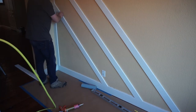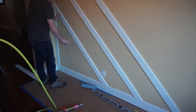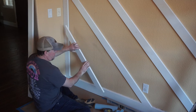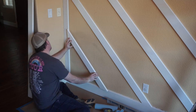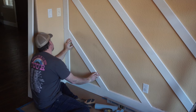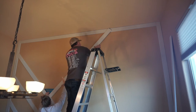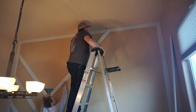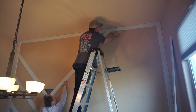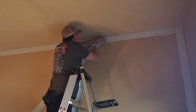Make sure that you wipe up any of the glue squeeze-out on the edges of the trim boards, otherwise you will see that through the paint. A carpenter's square comes in real handy for establishing these first angles, and then after that you can use a cut spacer for the subsequent board placement. You can see right here how I'm holding up a board that's just a bit too long on purpose and marking where I need the angle to be so I can make the perfect cut on the miter saw.